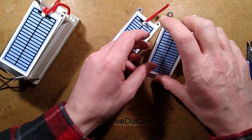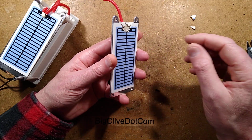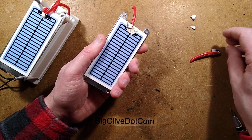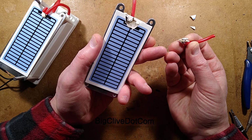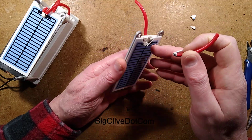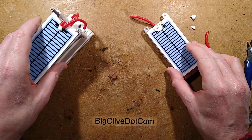So what was happening there when this was shorting out, because these two assemblies were in parallel and it needs that voltage to actually arc across and create the corona discharge, because it was effectively shorting out one plate, all the energy was being arced across in here. Yeah, you can see the burn mark there, onto the back plate, and that basically shorted out the unit. It clamped the voltage down and stopped the rest of the unit generating ozone.